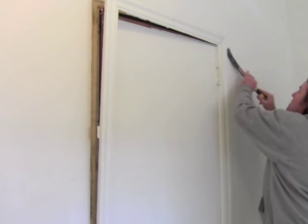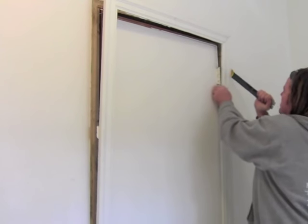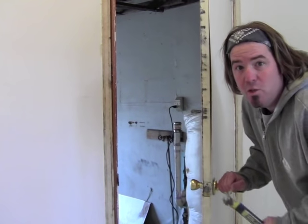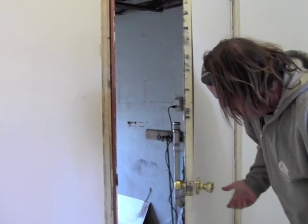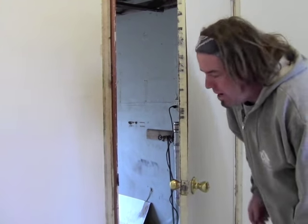This is an old-school house. Looks like they used long finishing nails — might come off all in a piece, and that's going to lift right out. So this is what happens to a door when you use an interior door where an exterior door should go. We're going to go ahead and throw away this knob since it's an interior bedroom doorknob and put a deadbolt on there. If you're going to reuse your knobs, go ahead and pull those off.